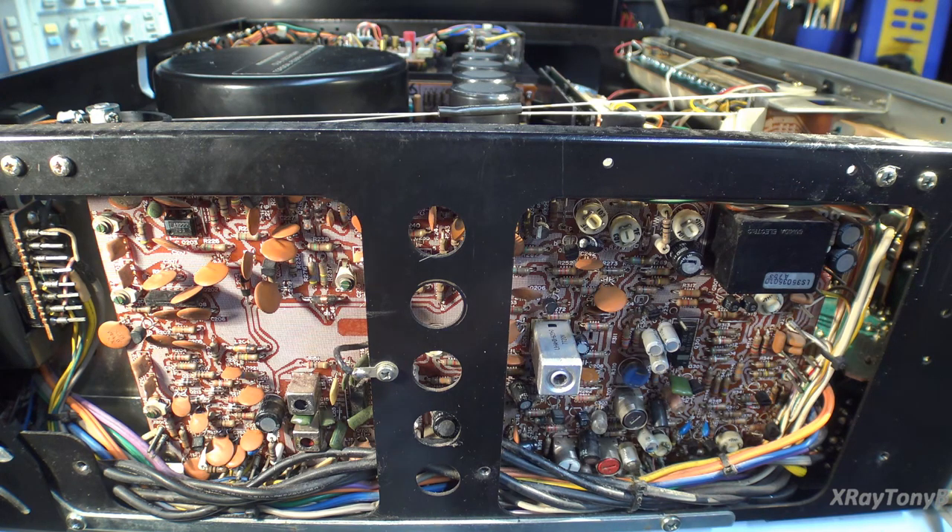Those coils are specifically bent to different sizes, shapes, or different distances between them — that's how you tune the circuit. It's very critical. If you get too aggressive cleaning and you move those coils around, or change the wire routing, you can throw the circuit out of tune. So use common sense. This method has worked for me because I know the pitfalls, but I don't want to mislead anybody into creating more work than necessary.